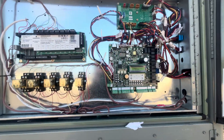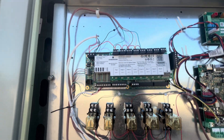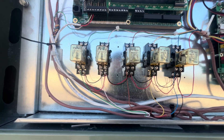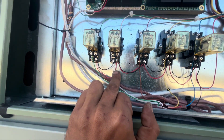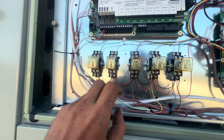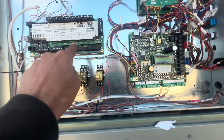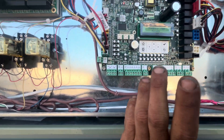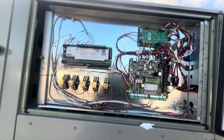That's not going to fry another $800 board. Once those relays close — wired to the coil voltage in my isolation relays — my common will close to my normally open, which I have wired into my thermostat connections, and we'll turn the unit on. That's the resolution to the problem.